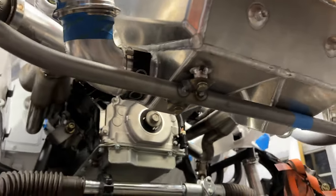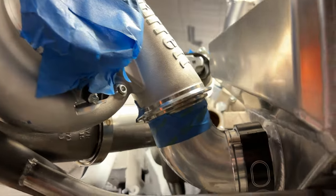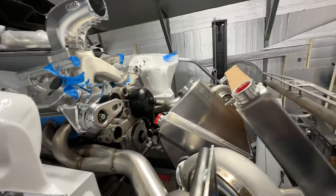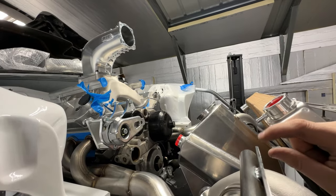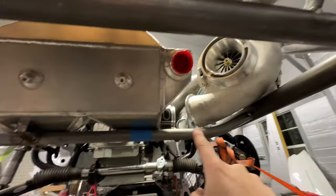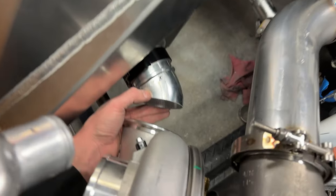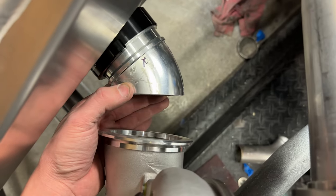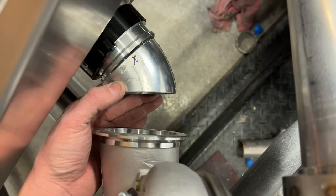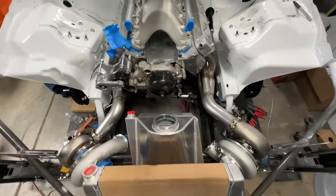So what we have here is I actually ended up going ahead and adding the mount for the intercooler. It's mounted now, and this is in there, up there and tight to the flange. Pretty much everything's where it needs to be. As far as location-wise, this ended up tilting back a little bit more than I wanted due to the length of the flange on the cold side. Actually, we're going to have plenty of room for a radiator on the inside if I want. This side definitely got closer, so we need to lower it down. Looking at the other side, I think we're looking pretty good once I can get this to set in — real close to lining up right into there. Straight piece in, and this side should be done as well. That is pretty much how everything's going to sit right there in the bay.